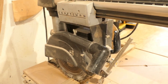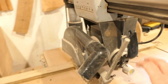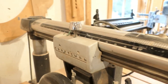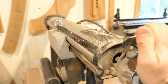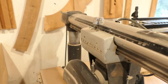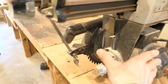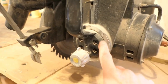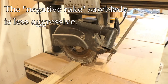Briefly, if you've never seen one of these saws before: it has a motor here, the saw blade is here, and it moves on an arm. There are some ball bearings in there and the arm itself can be adjusted to get different angles for crosscutting. For ripping, you can move this entire head 90 degrees, and you can also make angle adjustments down here — it can be adjusted many different ways.